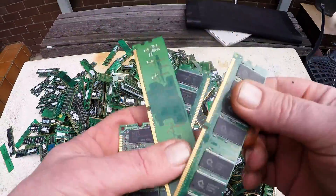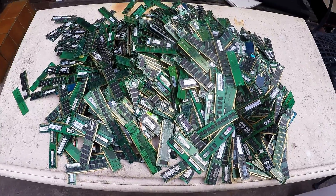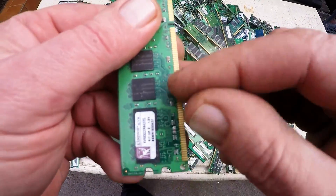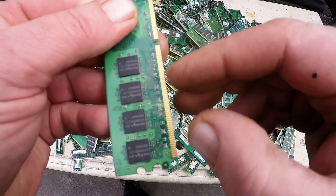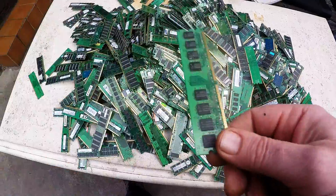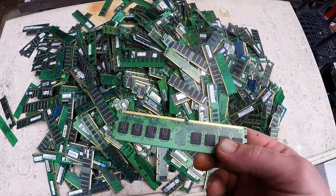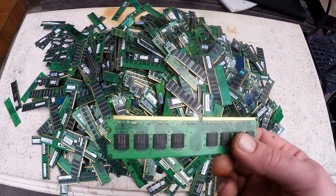About 17.5 kilograms total weight, which is about 40 pounds. What I'm going to be doing here is removing the gold fingers off every RAM stick using this soldering iron. We're not going to break the fingers off, we're just going to skim off the gold fingers. We'll have the gold and a little bit of copper underneath. All we need is anywhere between 8 and 14 karat gold — we're not going for 999 gold.